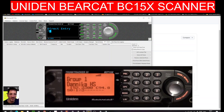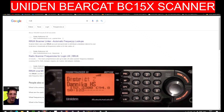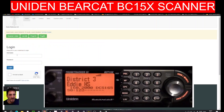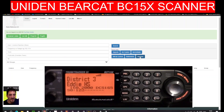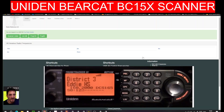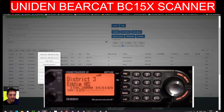The cable I'm using did come in the box. Let's go to Radio Reference - you do have to pay for this. Login, then go to Home. Let's click Bristol, 10 miles, and do Amateur - two meters. So we've got this now. I think it exports as an HPE file, so I'll go Scanner Export. I can't see other makes listed, so it could be a CSV file - maybe a CSV will work. I'm going to export both the HPE and CSV files and see if I can get them in.